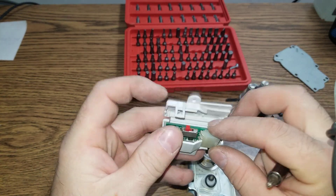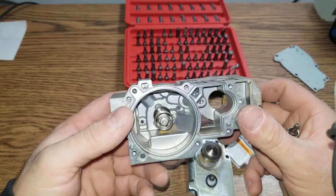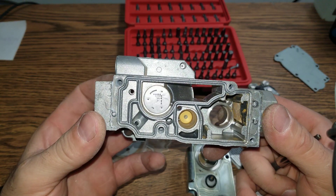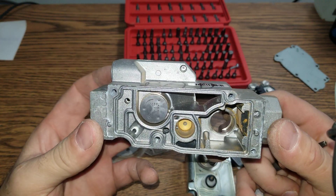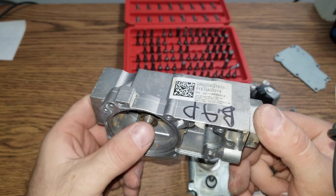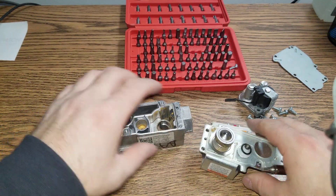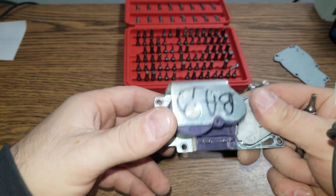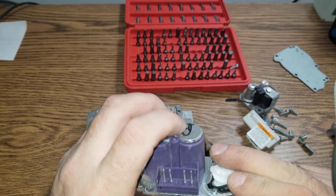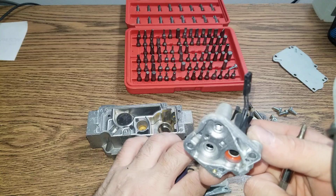That's it about this video, about this gas valve. That's all I can say — just to take it apart. I can't explain any better how the gas goes through and what happens, because this is two stage it's a little more complicated, and there is no information available that I can determine exactly how the gas flows through this assembly, how it regulates down to three and a half inches of water column. These are just the regular solenoids — one solenoid here. It's pretty heavy. Looks like there is another solenoid here, and that's another solenoid.